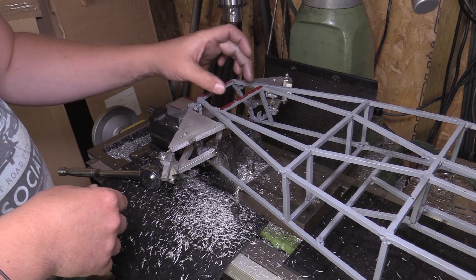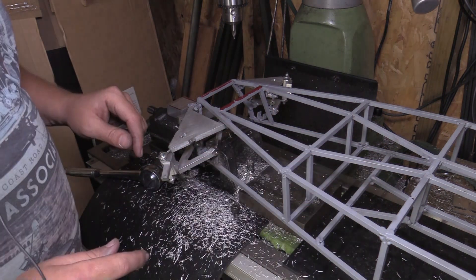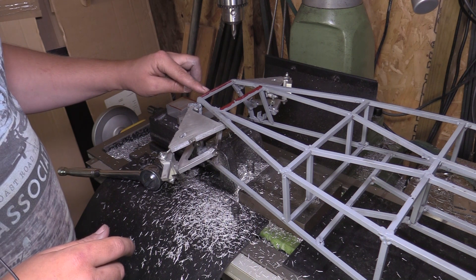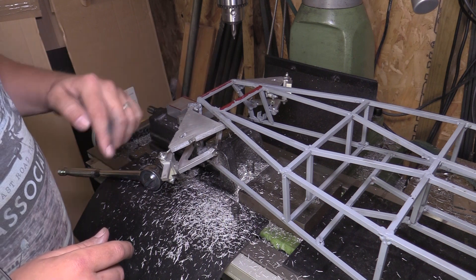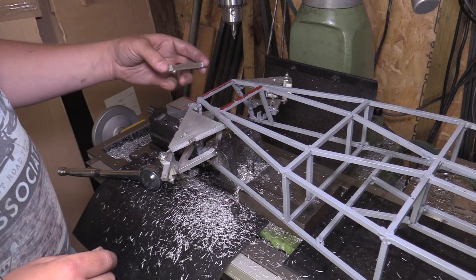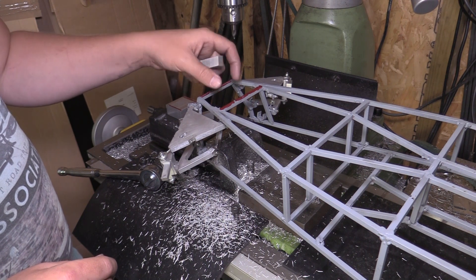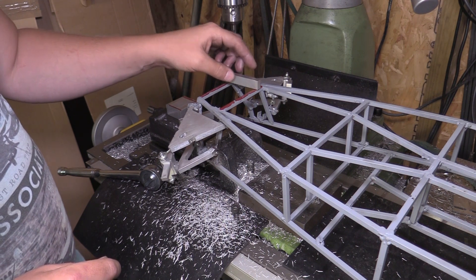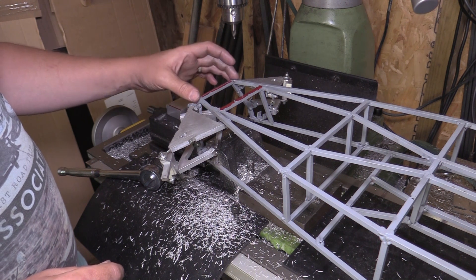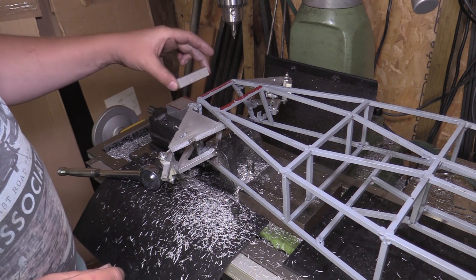I've decided the best thing to do next is to drill the holes in the chassis, so I've got the chassis in the machine vise at this end and packed up at the other end to get it level. There'll be two holes to go in the front cross member and two holes in the rear cross member. The reason I'm doing this first is so I know what hole spacing to put in the supports - it'll be easier to make the supports match the holes in the chassis, because if I'm off slightly and miss those holes there's a big risk of it coming out the side. This is a fabrication so tolerances won't be as good as what I can achieve in machined parts.